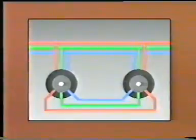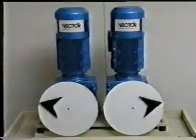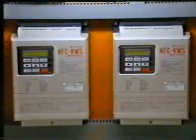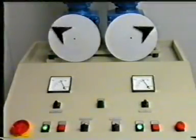An electrical connection can be produced by using induction motors. A rotor is moved by a rotating magnetic field, inducing an alternating potential in the rotor windings. Difference in phase means difference in potential. Connecting the corresponding rotor windings removes this difference in potential and so difference in phase; the motors are forced to keep in phase and synchronisation is guaranteed. Synchronisation is easily achieved in direct current motors. A tachymeter measures the speed of rotation of the motor. A difference in angle leads to difference in potential, and then to correction. Distance between the motors is of no importance.